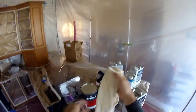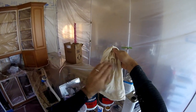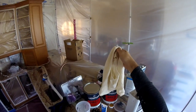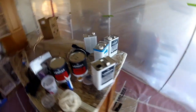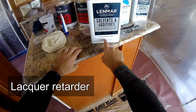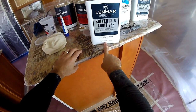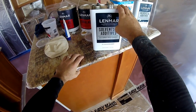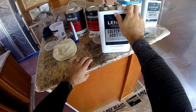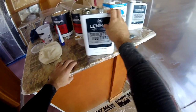We also have a head covering so you don't get anything on your head. When you put the Vaseline, whatever area of your face is exposed — that is the area you want to Vaseline. And then we have lacquer retardant. Depending on your humidity and weather, you can use as much as 20% of this and as little as 5%, depending on your atmosphere.